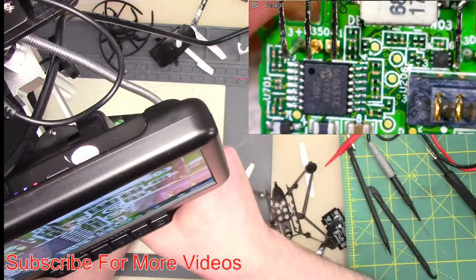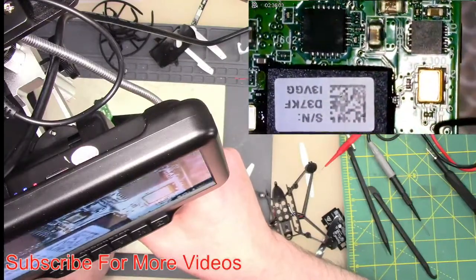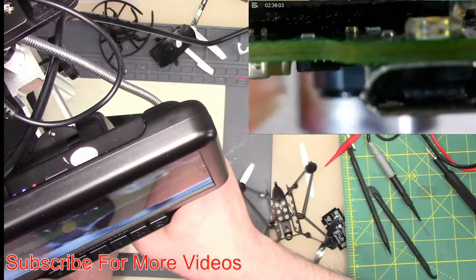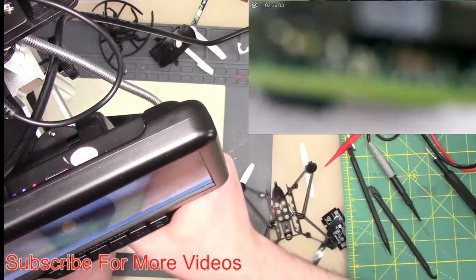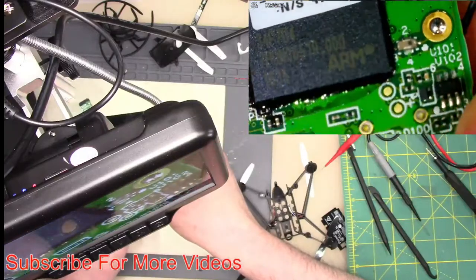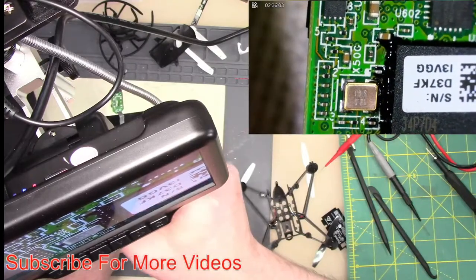This is pretty insane for a board this small. I don't see any BGA chips other than that ARM chip. Is that ARM a BGA? It appears to be. Appears to be underfilled too. Yeah, that definitely appears to have some kind of underfill around it. So I'm not sure. I would assume that it's a BGA chip. So, crystal, what kind of crystal do we have there? 12 megahertz crystal.